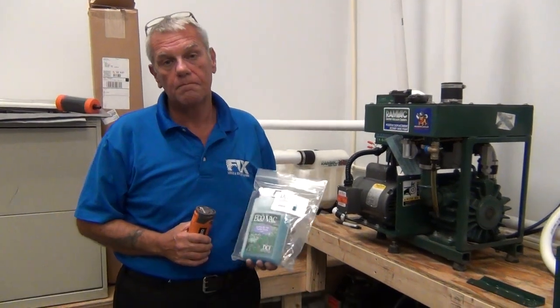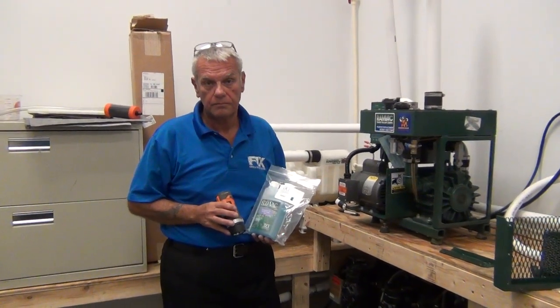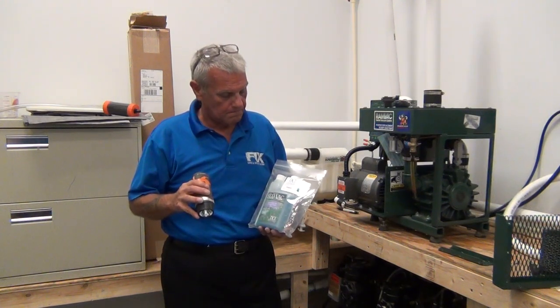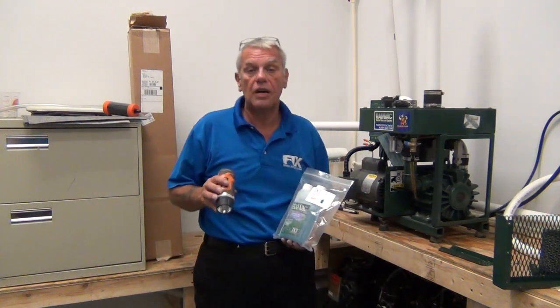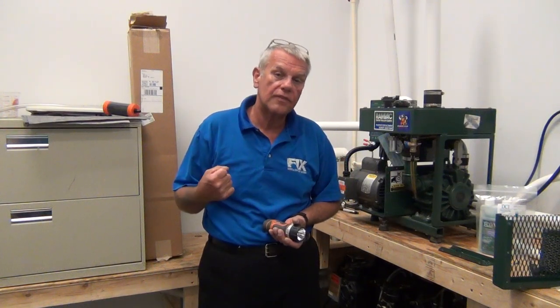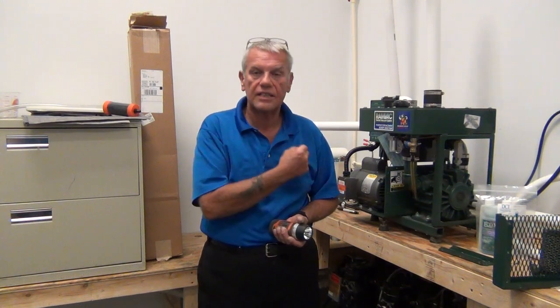If the office staff is not versant with the maintenance on the pump, we have several support products to help them. It is your job to educate the doctor and the staff on how to maintain their equipment. It will also endear you to them and make you virtually indispensable. DCI makes a product called Ecovac — it's extremely green-friendly and non-foaming. Any kind of cleaner you want to use in a vacuum system must be non-foaming. Go over with the staff how to aspirate the cleaner concentrate once a week to keep the system clean and clear. That's the best thing you can do for this pump.